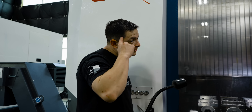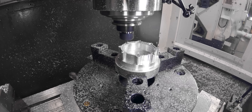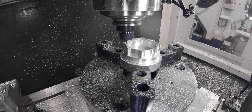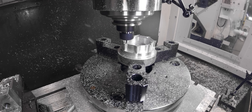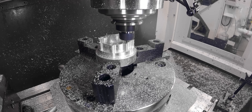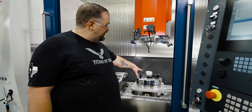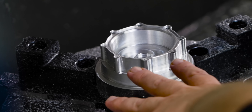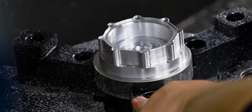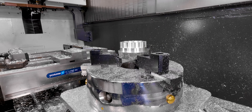Why is it yellow? Chris, I'm colorblind. Now we're into our finishing passes and again, because our chips are so tiny, it's creating a more increased fire hazard. If we were running this with coolant, none of this would be a problem — we'd just program it like an aluminum part and go. Every surface you see here has now been roughed and finished. We didn't catch anything on fire, which is awesome because I wasn't too confident we were going to get to that point. Now it's time to take our part out, cut our soft jaws for op 2, and run the second operation.